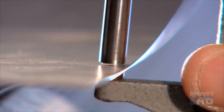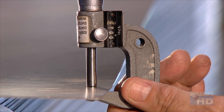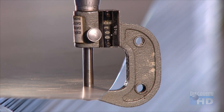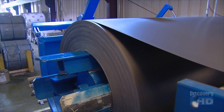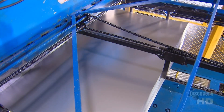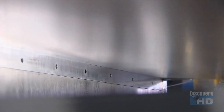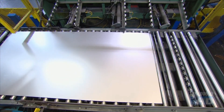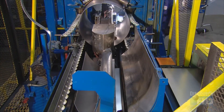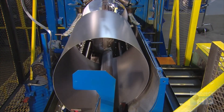At this station, they check the thickness of sheet steel that will be used for the body of the drum. The thickness varies depending on what the container is to hold. A machine called a shear slices the coiled steel into sheets. The steel sheets then move on to a forming machine, where rollers curl them into a tubular shape that is the drum's shell.